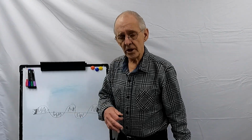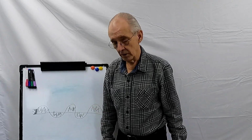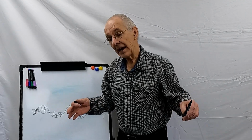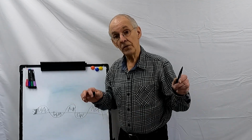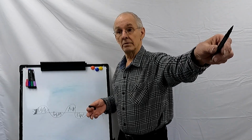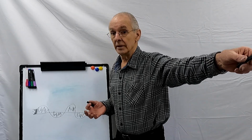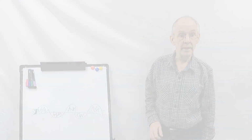So as an example of the machine I was just talking about where I noticed that there was a 480 volt breaker in the top of the panel, that breaker was not to protect against a fault like this. It's protecting, it is, but the fact is that breaker is unlikely to trip quickly due to the fact that this machine is fed by a cable that goes across the building to some panel someplace else. So that makes it really dangerous because of the wire voltage drop and the panel being, if the panel's not the main service, then it may not be able to supply that much current. And this is where the hazard of all arc flash comes in.